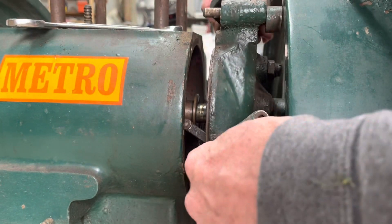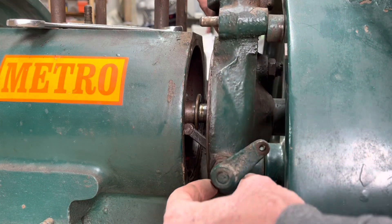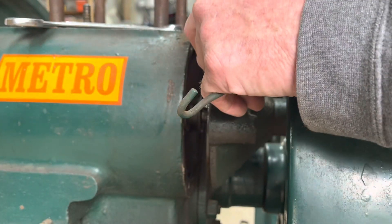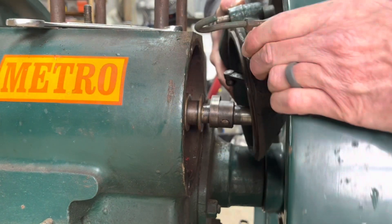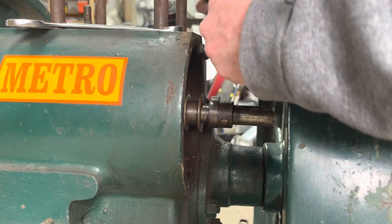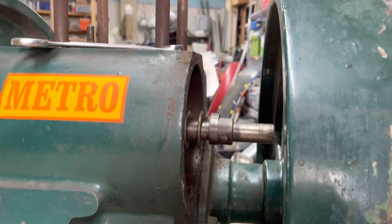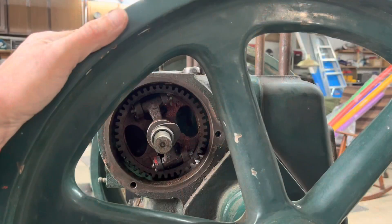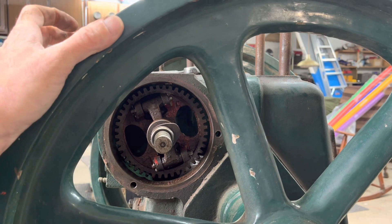You say 'it's not clearing' — it's kind of hard to do. But you get it on its side like this, and there it is. You might have to turn the crankshaft a little bit. Once the governor assembly is out of the way, you can see that you've got a clear shot and the camshaft will come out.